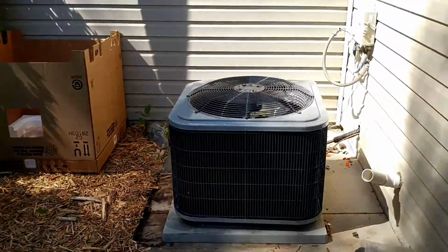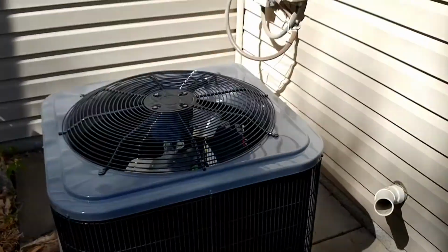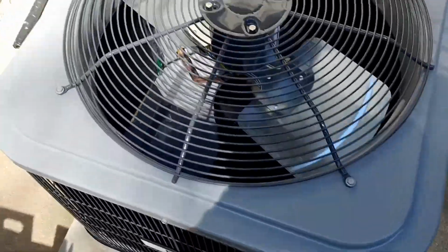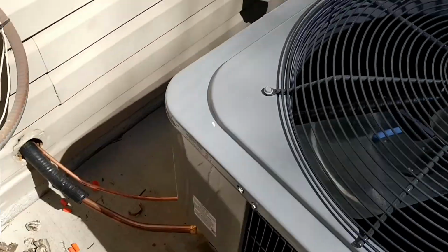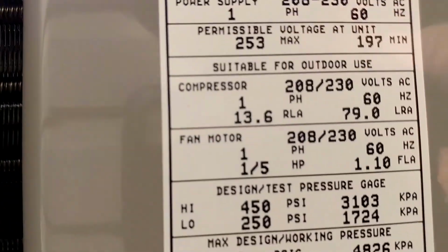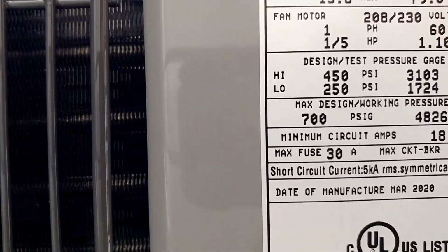Where she's got eggs, just to let you know. Forgot to video this one. We just took out an empty Lennox unit, and we're throwing in another 3-ton here. Short line set right through the wall there. Checking my breaker. What do we got? 30 amp. That's what we got in the panel, so we'll leave that.